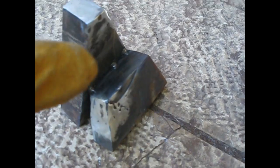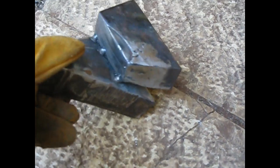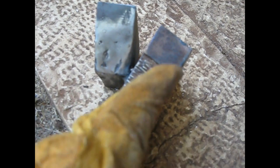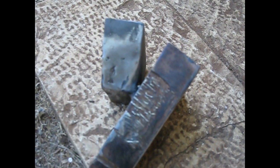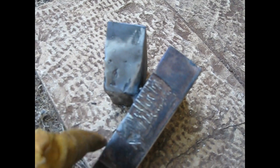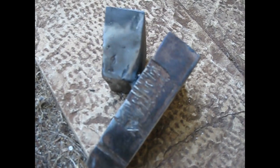Now you can see the angular horn, the two bits are just tack welded here. I'm going to make the first bead with the 6010 on both sides, and keep on welding, and with the 18. For sure this top bit is going to bend because of the heat. I'll try to avoid it by welding the same amount of beads on both sides, and let's see what happens.